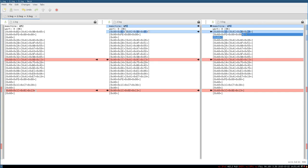I think this write is to end a transaction, because we can see there's one transaction here, it writes at this address. And we see the other transaction here with writes after the reading. I think in the beginning it reads a special field to figure out which kind of card it is. Is it just a card which has just value on it, so I can add value or add money or subtract money, or is it one of the maintenance cards which do some other things? Since I don't have a maintenance card but a normal value card, I can only tell about this. I can only tell the values about the credit cards, like value cards.